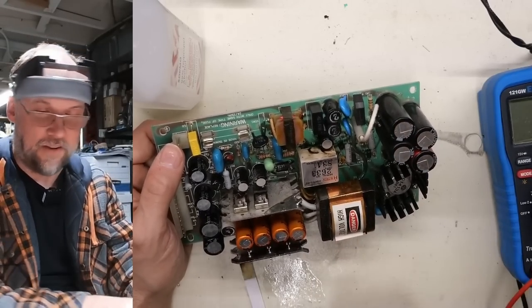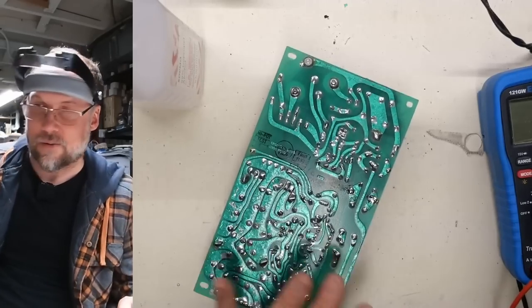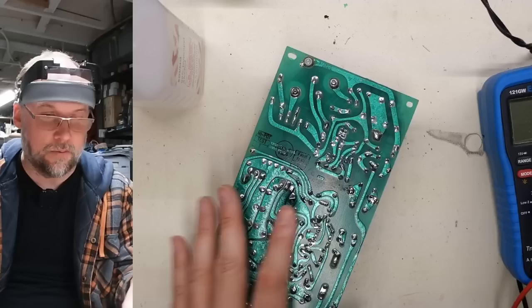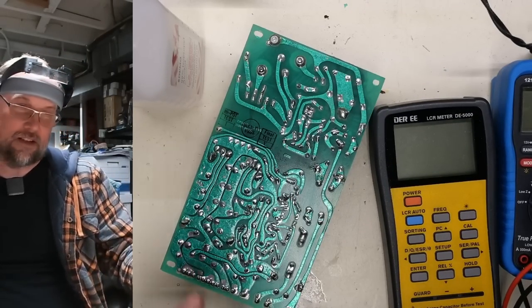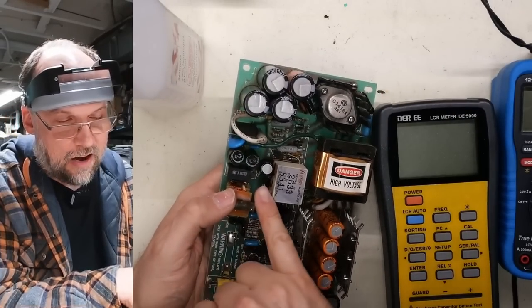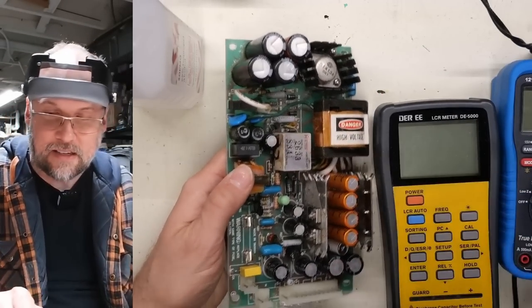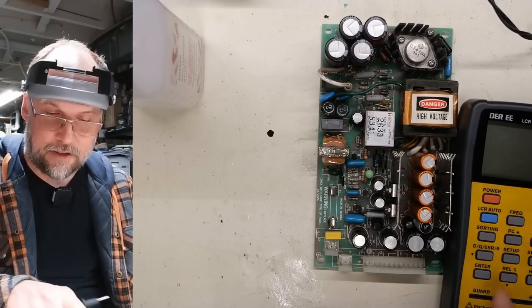I'm trying to clean off this gunk and it's not coming off very easily — pretty stubborn. Unfortunately, when that Rifa blew, it kind of blasted this little capacitor right here that I have the q-tip sitting on. That cap may need to be changed — it's the little reservoir cap that actually starts the whole power supply up. If I plug this in and it doesn't blow the fuse but doesn't start, I'm going to suspect that cap is also damaged from the little explosion from the Rifa next to it. That cap is common to go bad, especially when it's near things that get hot, like that resistor right there that probably bakes it.